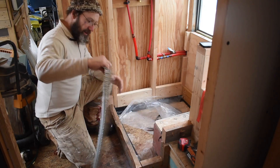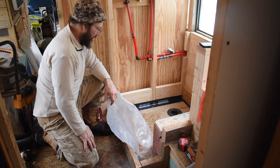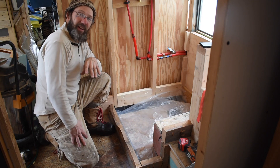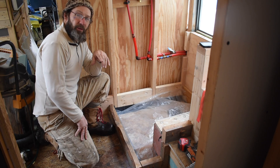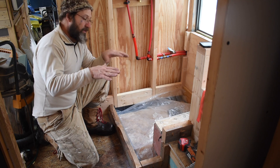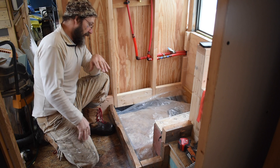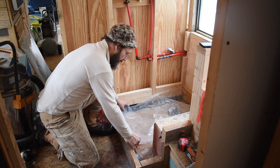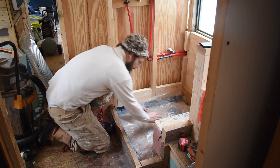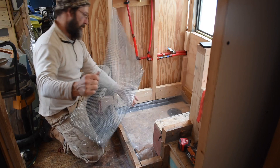We're working on the shower here and I got it framed out and I'm going to do a mortar pan. I've never done this before, so this isn't the only way or even necessarily the right way — it's just my way. I want to put a base layer of mortar down first to provide the slope, then the liner on top of that so the liner itself has a slope. If any water gets down there it will slope toward the drain. It says to put some tar paper or something down so moisture doesn't wick into the floor. I didn't have tar paper but I have this poly here, so I'm just going to set this down to keep moisture from going into the floor. Then I got this metal lath laid here.